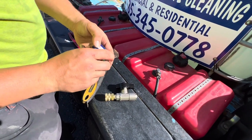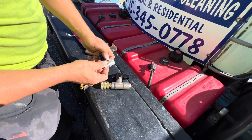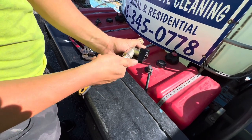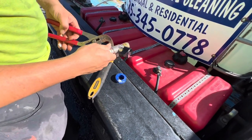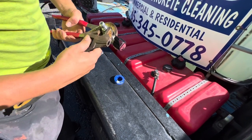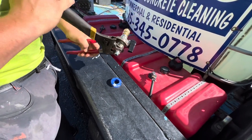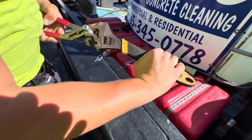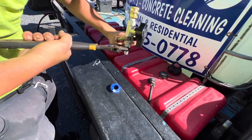So here goes our second fitting. The link's going to be down in the description for these parts. This will work on just about any pressure washer out there with a 3/8-inch hose. I think these ball valves are rated up to 5,000 PSI — don't quote me on that, you have to check the specs on it — but we're nowhere near running 5,000 PSI. You want to keep the Teflon tape flat as it's going across the threads; it helps it seat in the threads better. And don't use too much — wrap around it three times, that's good enough. Just enough on it; that should be plenty tight right there.